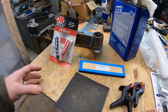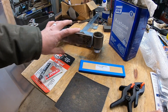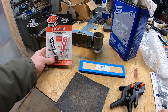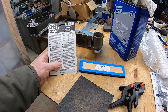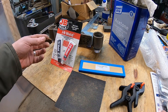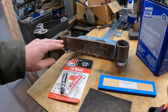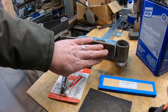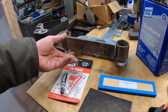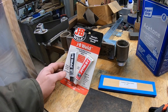These are the things I use to complete this project. First, you have your plate — I'm going to leave it mounted to the tool arm since I've already got it adjusted and set for tracking. I like to use JB Weld for a couple of reasons. It's an epoxy, but it also has constituents in the formula that provide structural support to whatever you're putting together. Unless you get this piece of steel completely flat — which is very difficult without a milling machine or surface grinder — there will be depressions or unsupported areas under the glass. You need something that fills those in and still provides support, and JB Weld does that very well.